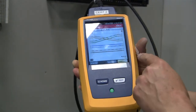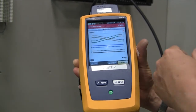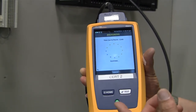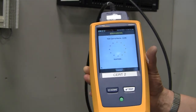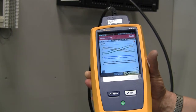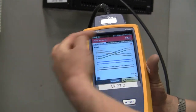The other thing we will do on this test is we'll probably need more information. For example, we're going to look for the near-end crosstalk reading. Right now it told us a bad wire map, but we're going to continue the test to get some information and generate a complete test.